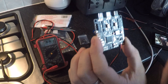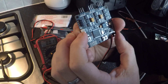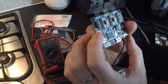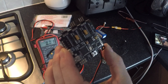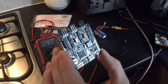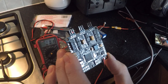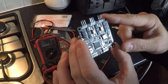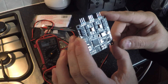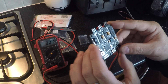What instantly stood out with this board is that the order of the pins is completely different to any board I've seen before. Usually VCC and ground are at opposite ends with SDA and SCL as the two central pins, but this one has SCL and SDA, then ground, then VCC — a completely different order.